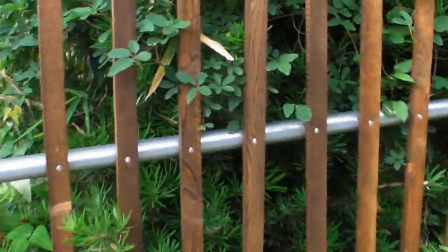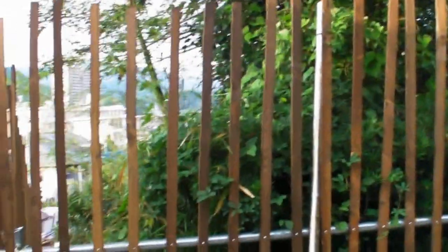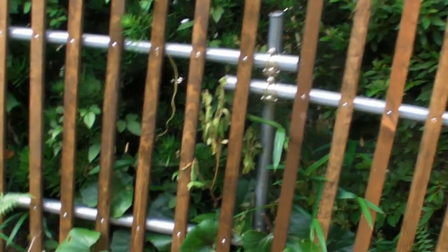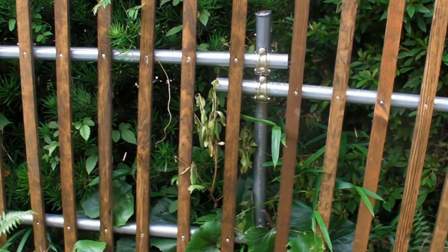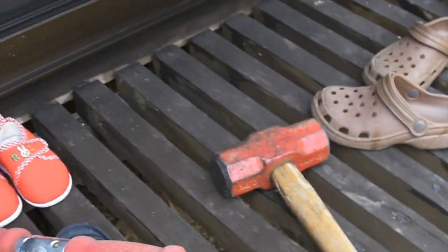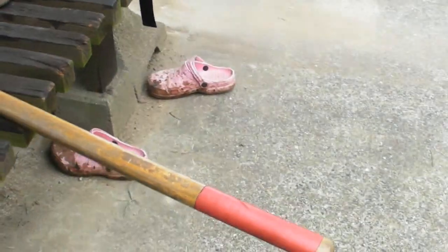The most difficult part is: you get a two-metre scaffolding pole and you stand on the top of a step ladder and bang the poles into the ground for about one metre. Depending on your ground, if you can't do it then that's the end of this fence-making method, but in most soil as long as you don't hit a rock, you can drive the pole in using a sledgehammer.